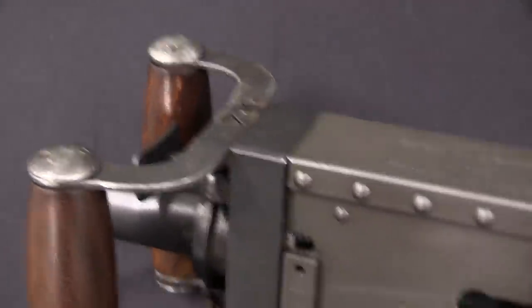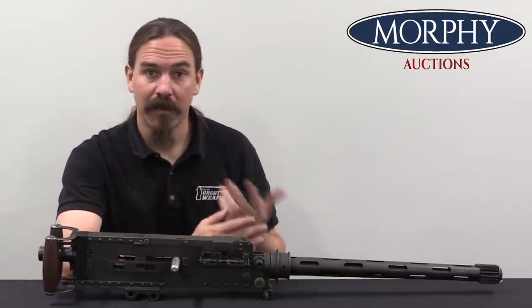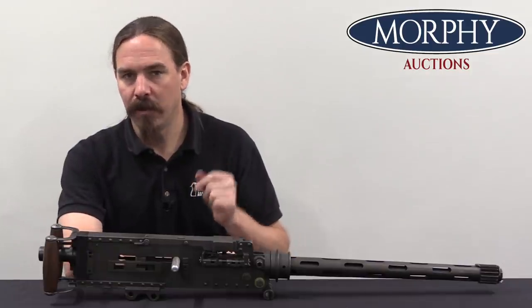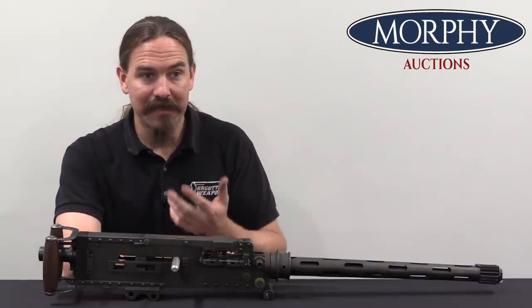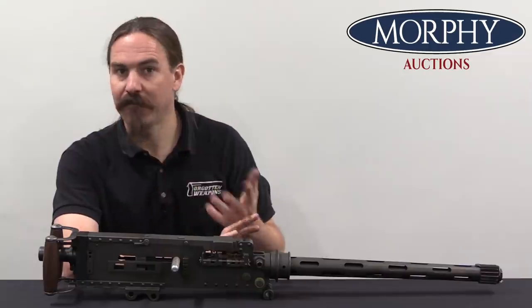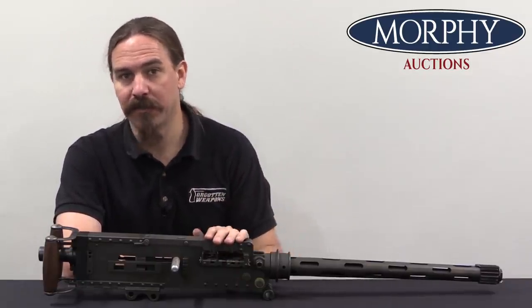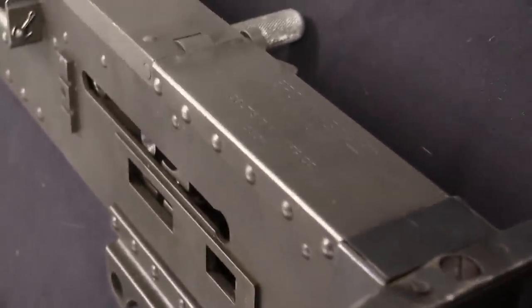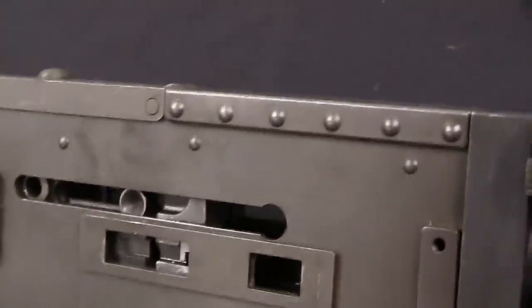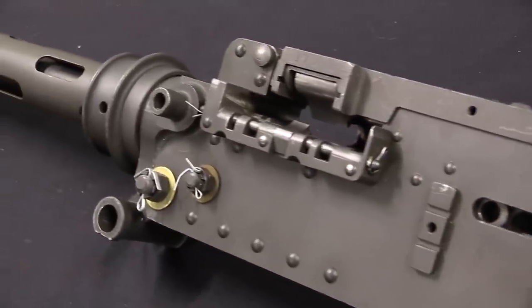Mechanically that's done primarily by lightening the working parts, so that there's less mass to get moving, the bolt can cycle back faster, and then the recoil spring, often made a little bit heavier, can push the bolt back into battery faster. This ups the rate of fire, and that's what Colt did here. They also wanted to lighten the guns, because every ounce or pound of weight in an aircraft reduces that aircraft's performance, flight time, and everything else. So what Colt developed was a gun mechanically very similar to the standard Model of 1919, but smaller and with lightened operating parts. The version that the British decided to adopt was the MG40, released in 1930, and the British adopted it in 1935.